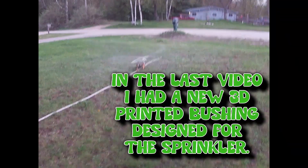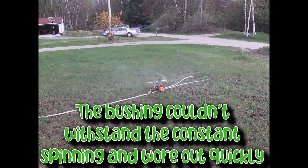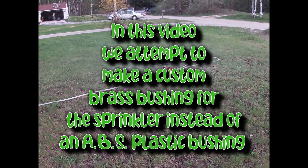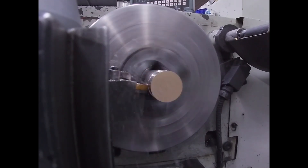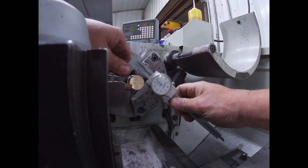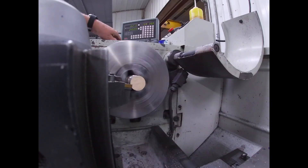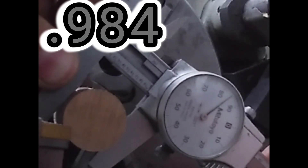Got the old yard crest lawn miser — got it from my old history teacher slash good friend Bob. We're starting by taking a cleanup cut of the piece of brass I have, then I'm going to get a measurement. I think this was one inch and it's typically oversized, so after the cut it was an inch and five thousandths. I'm just gonna start to make cuts — the number I needed to get to was 875, or seven eighths of an inch.